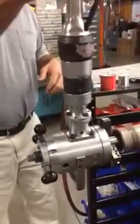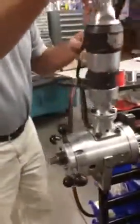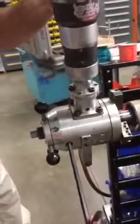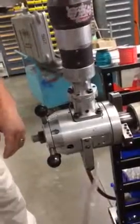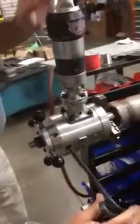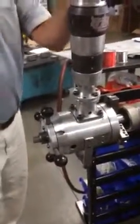You see this — this thing will rock on the shaft. Do not machine if it's loose like that. How you take that play out is on this side there's a screw that you tighten down onto the shaft, and here's one, two that you tighten down on the shaft. Try to tighten them equally.